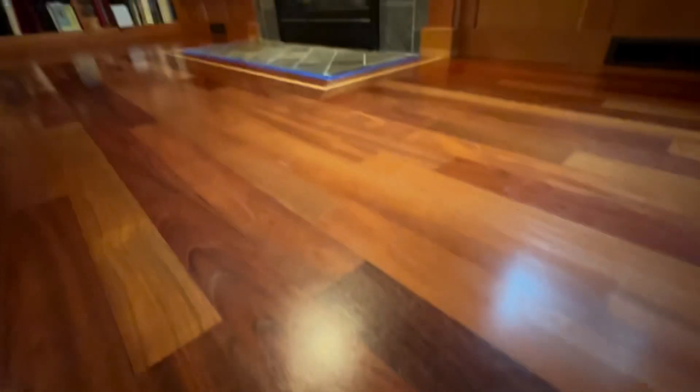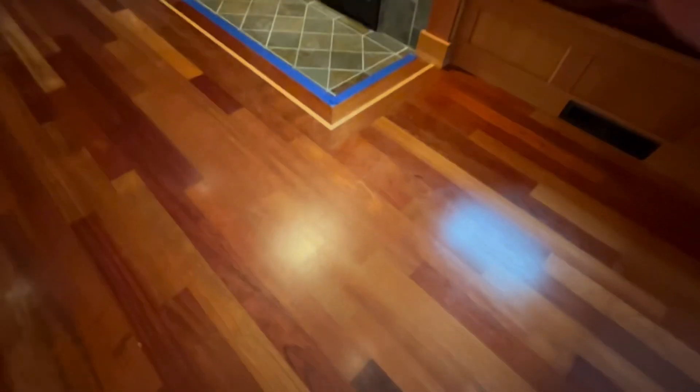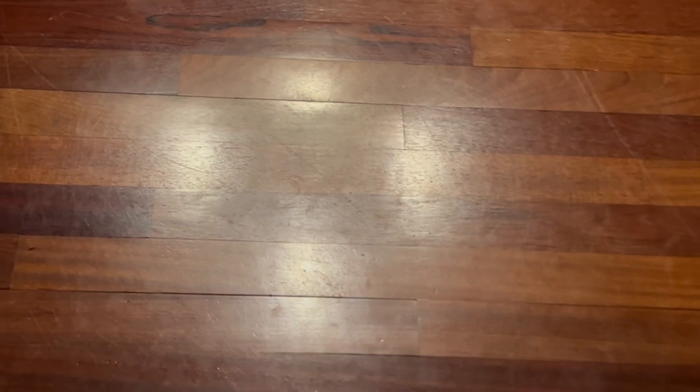There's a lot of micro scratches and scratches in the wax itself, not in the original floors. And these are solid wood floors. You can see all that scratching going on, all the little micro scratches in there as well. There are a lot of dark patches. This is what will happen with these acrylic products. It's like a wax — you can see how thick it is. As you get layer after layer on your wood floors, they can actually warm up in the summer or when the heat's on and get kind of pliable, and all the dust will land on it. You'll just traffic it in there, and now you've got this dirty wax on your floors.